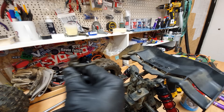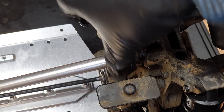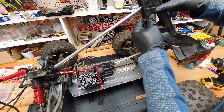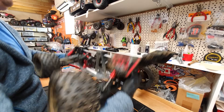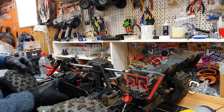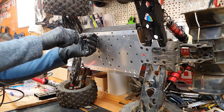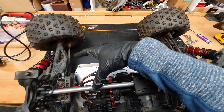On this end we've got to adjust it so it lines up with the hole and then lock up the lock nut. Same again on the top bar. Then we've got to do the same to the other side and we can get the servo module back in.